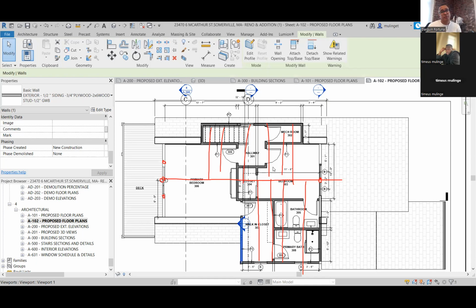It's like a trapezoidal beam, to be honest, because it's gonna have a trapezoidal load here that's X distance, then it changes to be Y distance and Y distance in here, and then it changes in here. So it's like a multi sort of loaded beam. Now I'm not gonna use real dimensions, but I'm gonna show you real quick what I understand needs to happen, and then you tell me if you understand that phase. The first phase is we gotta size the ridge beam.